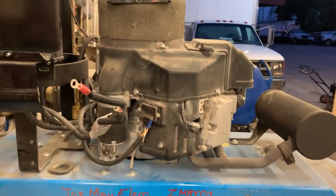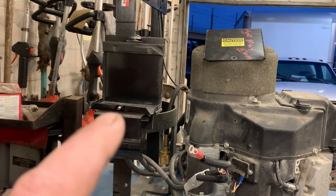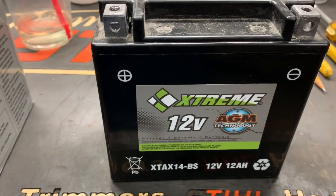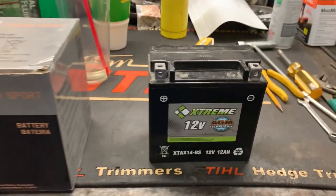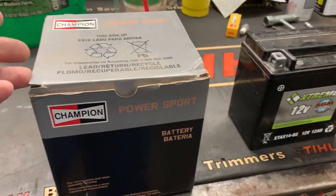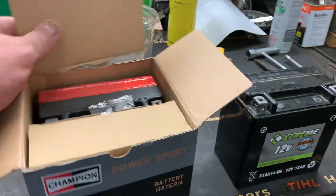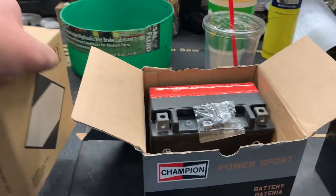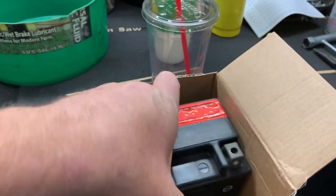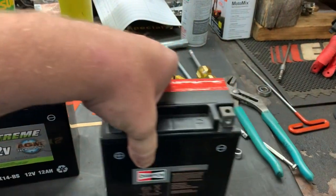We got a little low rider buffer on the bench and it's needing a battery. However, we don't have the AGMs — normally we get the absorbed glass mat battery — but whenever I ordered a battery for it this time I got this specimen here, which is a flooded cell lead acid battery. It will work just fine, but let me show you guys how to service one of these.